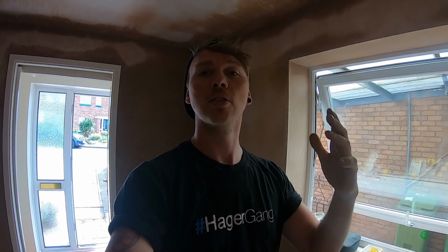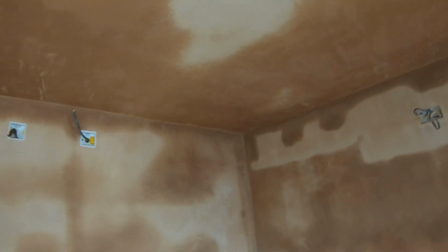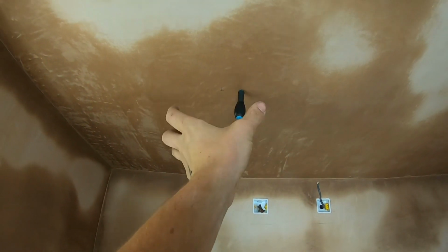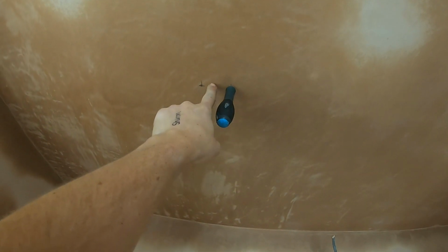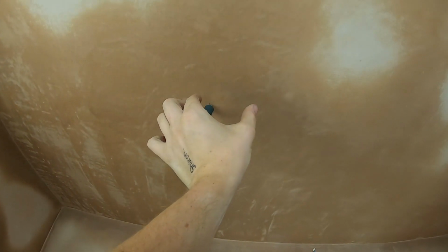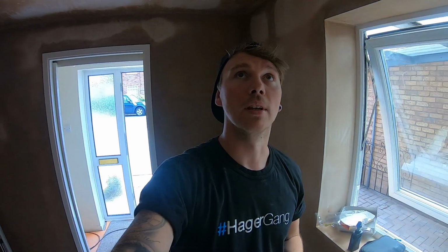So, right, just to be on the safe side, this is what I've done. I've gone over 60mm, and that's a 30cm screwdriver. So I've pushed that up, I'm going to look in the loft, find that. I've got my measurement across there roughly. I'm going to bring it in 60 as well, to make sure there's definite clearance on that one. Because the best thing, when this hole's here, if the joist is here, I've still got my clearance to come across and still incorporate that hole I've made with the hole saw itself. So find that in the loft, measure off that to that, see what's happening.